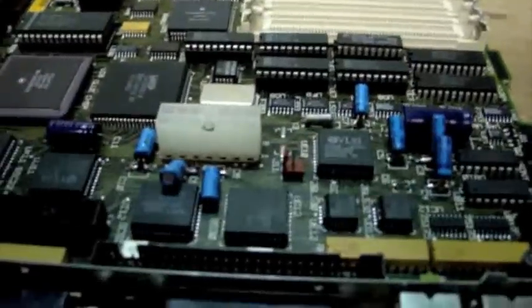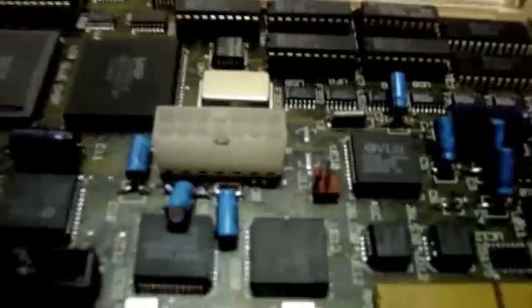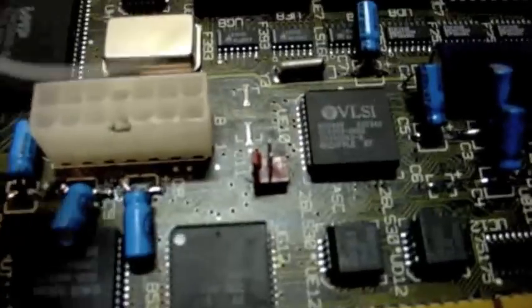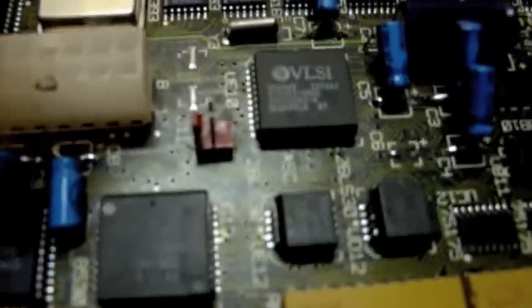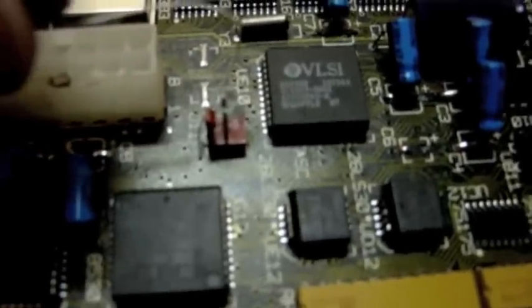The CCD imaging sensor is starting to act up again, but hopefully I can get through this. The problem up here was the vias were completely broken through. Here's how you repair a via: you take a piece of thin 30-gauge wire, strip it back, and carefully, using a temperature-controlled soldering iron, thread the wire while heating the via down into it. The wire will come out the other side. Just make sure you leave a piece of wire on both sides — that will allow you to flow the solder all the way through the via, most of the time.